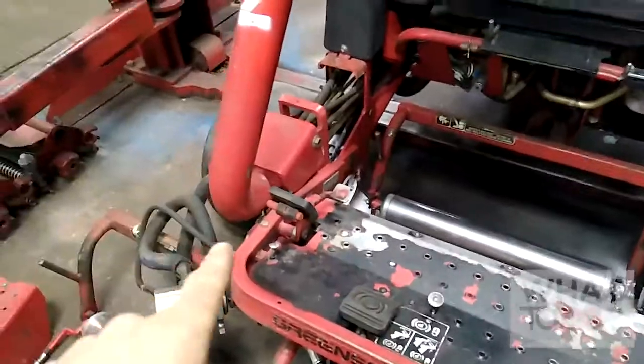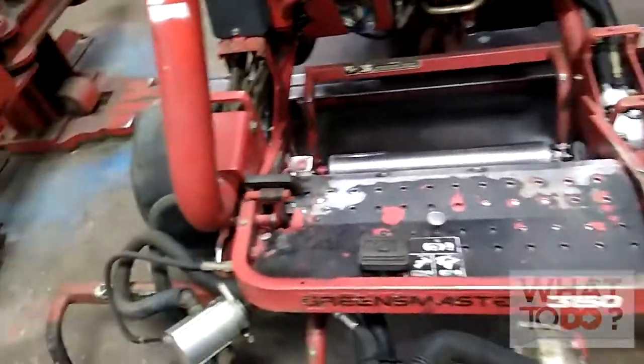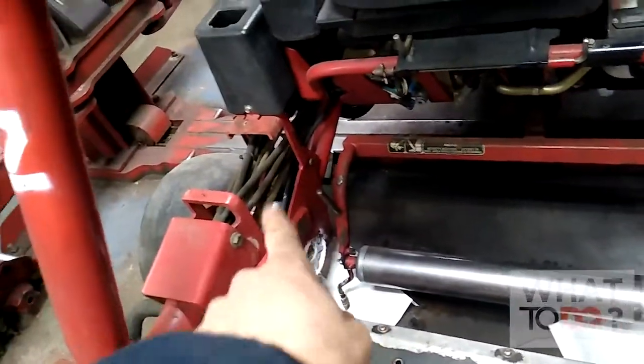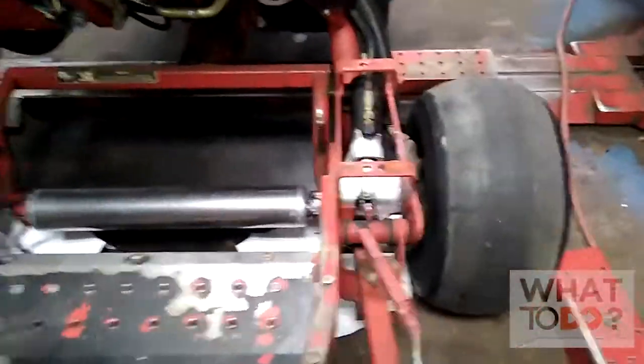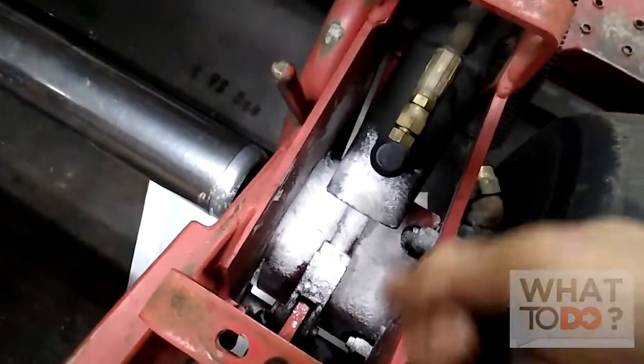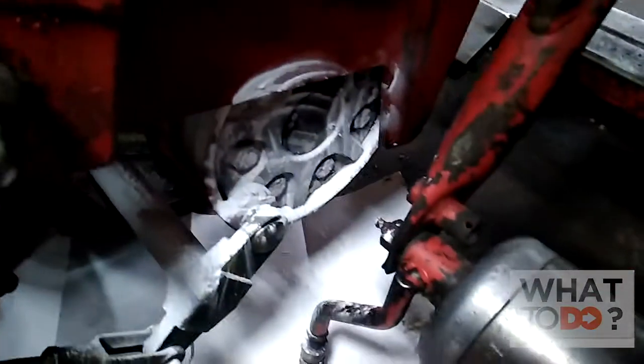Here's a simple technique I learned as a kid working on machines with my brothers. I've got a big leak — the machine was parked somewhere else but I pulled it in. I took some air and it looks like it's coming from the wheel motors down there. I blew everything off, got them dry, and covered them with baby powder on the wheel motor and on the lift cylinder.